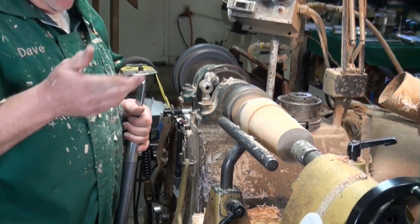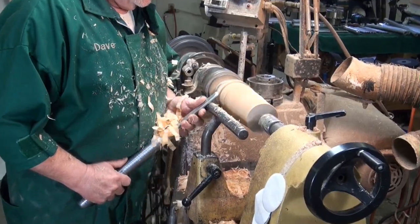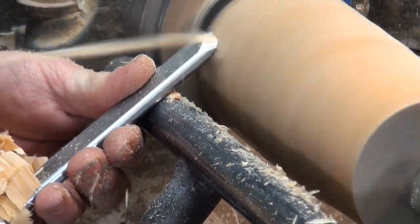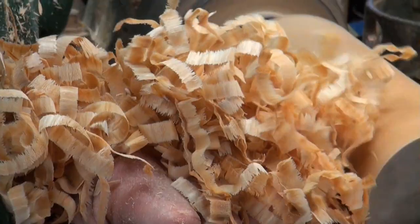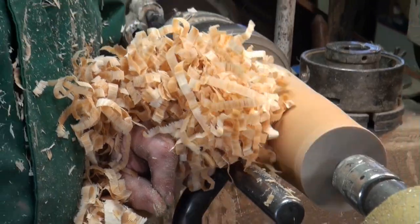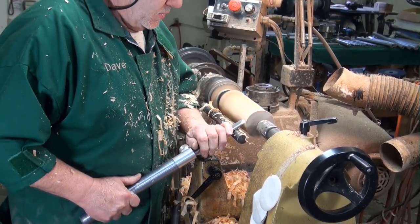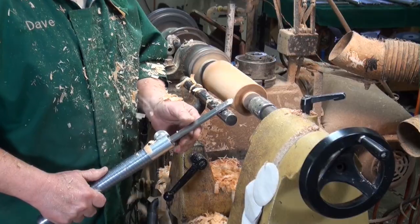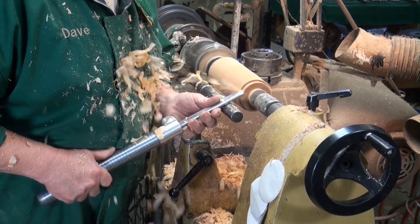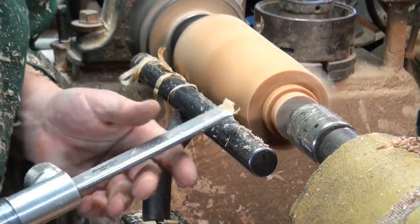As I finish the peeling cut, I just switched over to the radius part of this tool — the curved part. You can see I'm not getting beat up and not hanging on to this with a death grip. Up and in — that's a rougher that gets through the wood really fast. I don't think there's a more efficient way to rough out spindle work than with a skew. The smaller skew will do the same thing. This is a lot of fun. You can go both directions.